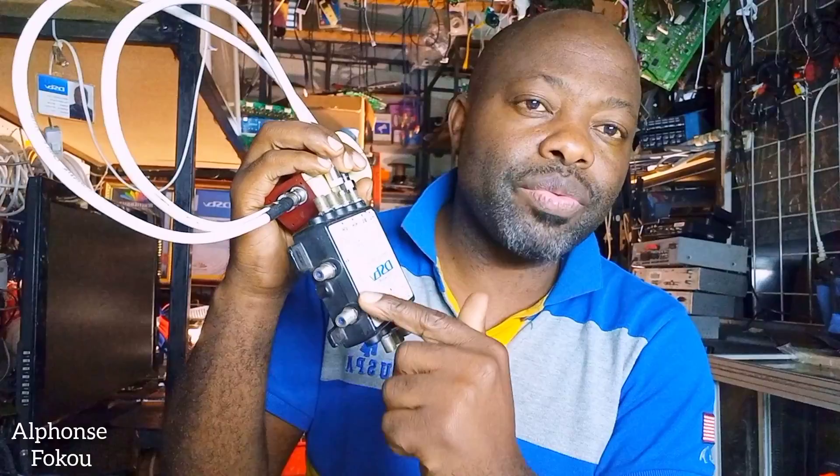You're going to put two universal inputs into the IS-20 and come out with your unicable. You'll come here with your unicable which is going to supply your Explorer. Or it can supply even two flats because you have two unicable outputs.